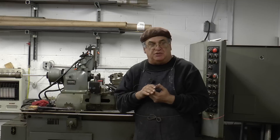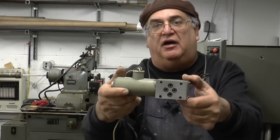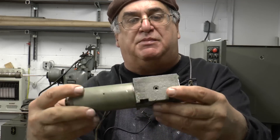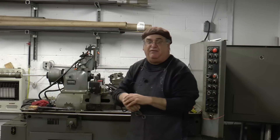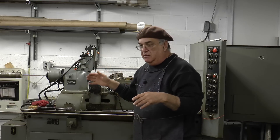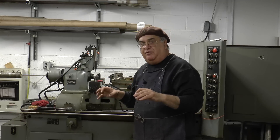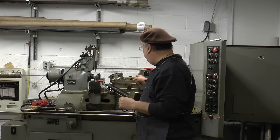What it basically was — it started out to be a timer, which turned out to be a switch. But when the switch wasn't engaging, we finally got that to work, but it still wasn't running because there was a hydraulic cylinder — a Vickers electric solenoid, 110 volts. This particular one controls the turret. I got a new one; I called Vickers, now owned by Eaton, and they gave me the new part numbers. So we put the new solenoid in — the switch was working, but it wasn't allowing the solenoid to open up, which controls the turret forward and return.